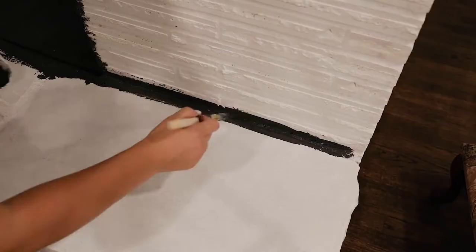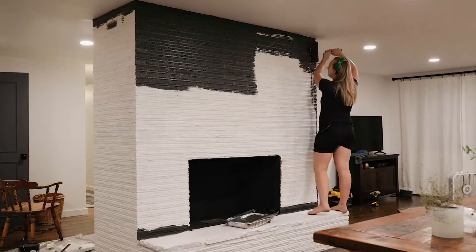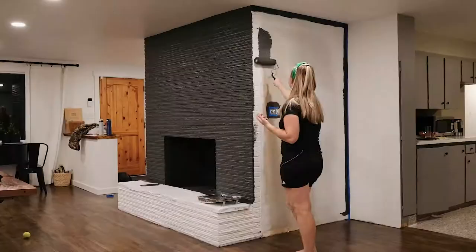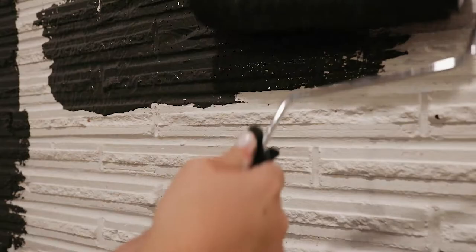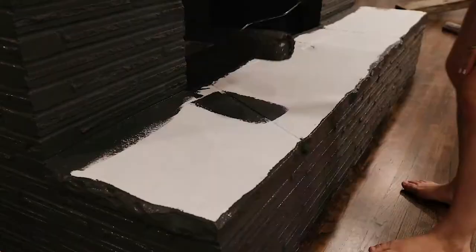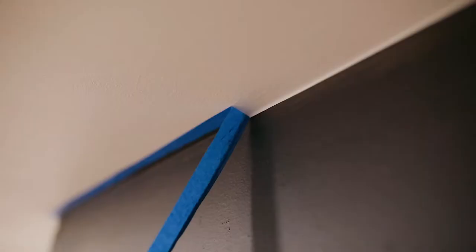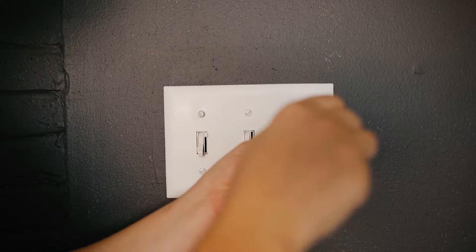This is the color that we chose and it was so hard for us to pick — we probably looked at hundreds of them. We decided to go with a contrasting color and really loved the dark, almost-black look, but this has a slight blue undertone and it just turned out so perfect and beautiful. The color is Carbon Copy by Behr. I did a lot of research on what the best paint would be for a fireplace, especially around the firebox where the paint would be exposed to intense heat. I talked with some paint professionals and they recommended an acrylic paint because it's designed for the exterior of homes and places that get really hot, like in Arizona — rated for quite high heat, so it was perfect for painting the fireplace.